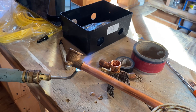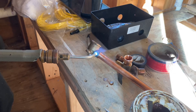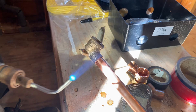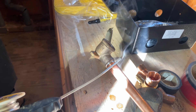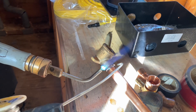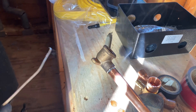I'm going to bring the torch to the fitting, and that cone at the tip of the flame is going to heat the fitting. We want to evenly distribute it around the fitting. Because this is a malleable brass fitting — unlike a copper fitting — it's going to take a little bit longer to heat up. And we're going to apply our solder, just like that, getting a little extra heat as we go along.